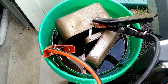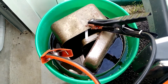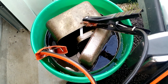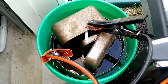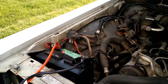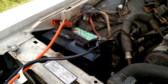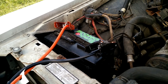I'll let this sit overnight and we'll do another video to show you what happens. There'll be a scum of rust on the top of the water, the other piece of metal will be rusted to heck, and the tackle box will have no rust on it. I just plugged it into my car battery — any 12-volt battery will work well. You could use a battery charger, though some newer ones are finicky and need to see a battery. An old battery charger or even a DC welder would work great.